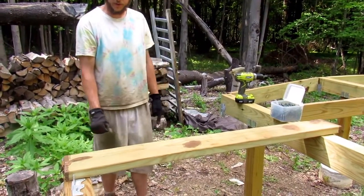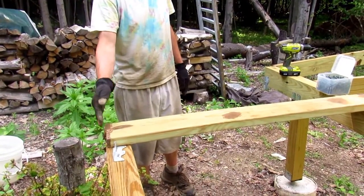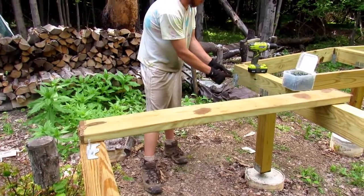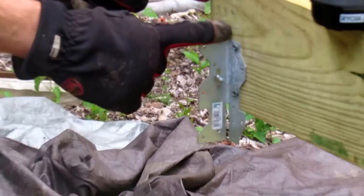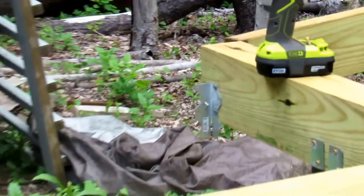The way you measure these joists, you can cut them at the angle and make them perfectly flush. We decided to just cut them straight. Measure in a board length on your 4x6 beam, make a line, and measure from that line to the tip of your other 4x6 beam.